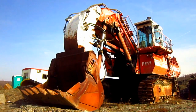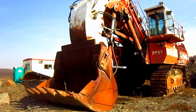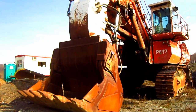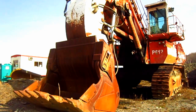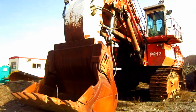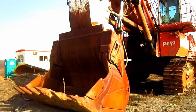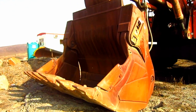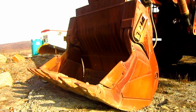Let's go and get a closer look at this legend. Available from O&K in either backhoe or front shovel configuration, depending on what the customer preferred, the RH-120C was designed to swing a rock bucket ranging from 11.8 to 23.5 cubic yard capacity in backhoe configuration, and swing a bull clam ranging from 13.8 to 23.5 cubic yard capacity in front shovel configuration.